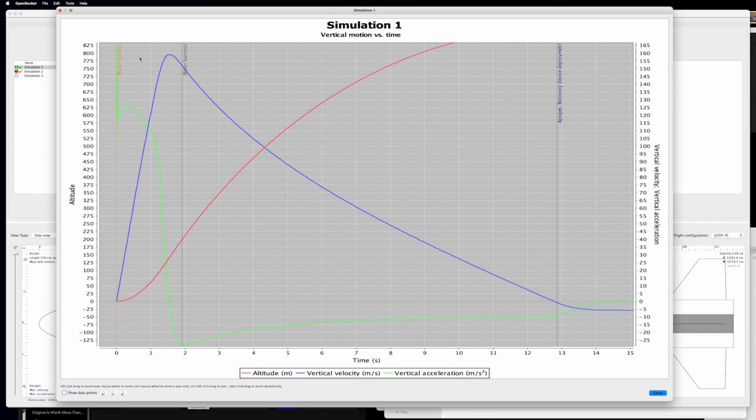When we lift off, our wet mass is just shy of 2 kilograms. So this is a beefy rocket between all of the wires and cabling on board, plus some very high infill parts to sustain shock loads. We have quite a lot of mass. That flight up to 850 meters is gonna have us pull, I think, about 12.7 G here.